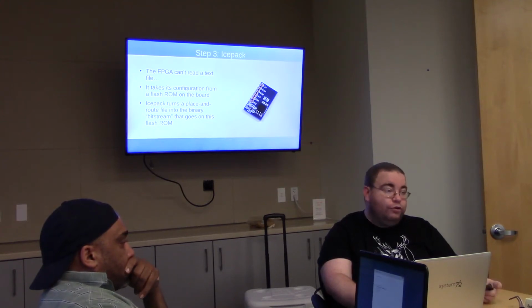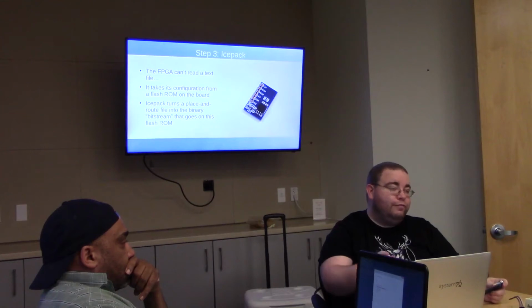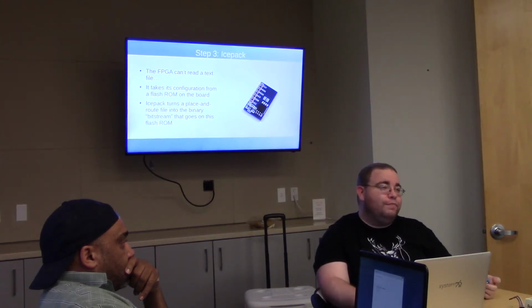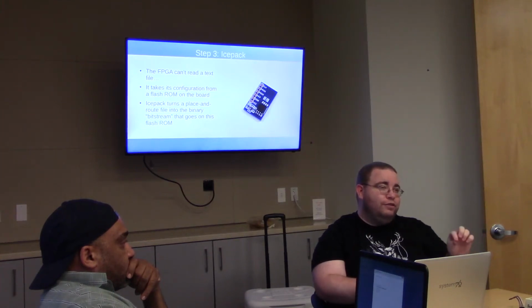You then need to get that onto your FPGA somehow. There are a few different ways to do that depending on the FPGA. This thing's actually got a whole separate data sheet, which is conveniently separate from the actual data sheet for the chips, so you don't think it exists for like two whole weeks. That will tell you exactly what it's expecting interface-wise from what's giving it the bitstream, which isn't a whole lot. It turns out that what it expects is an SPI chip that it can send a command of 9B to, and then keep on sending zeros and getting back bytes until it reaches 32K.